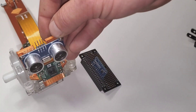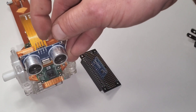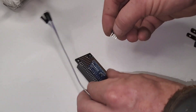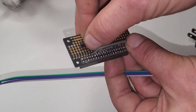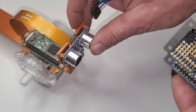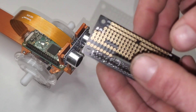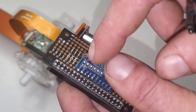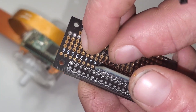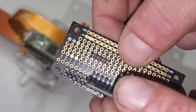We have to wire up the ultrasonic sensor. It's got four wires coming from it, and we're going to add four pins somewhere on here for those wires to connect to. We need five volts and ground for the sensor, and this has five volts and ground right here, so we'll put it on the same pins — two of them on the same pins.